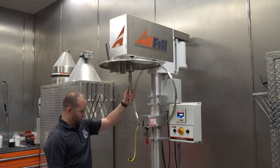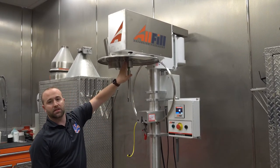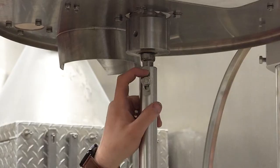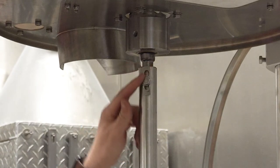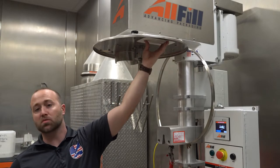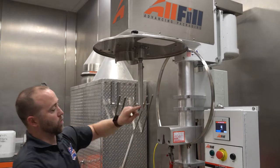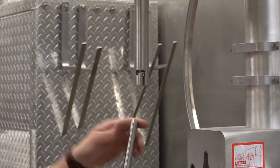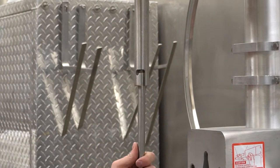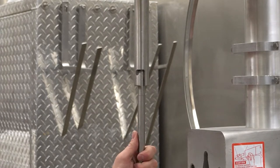Here is the shaft, the auger shaft, and we need an agitation blade that's going to attach to the spindle assembly. With the hopper removed from the machine, you can see the auger shaft slot that controls the auger height. That's where we do our auger height adjustment through the inspection window on the side of the machine here. So also when we are performing an alignment, with the hopper installed is the only way to do the alignment, and you're feeling for this spring-loaded pressure and that you're still able to turn the alignment rod.